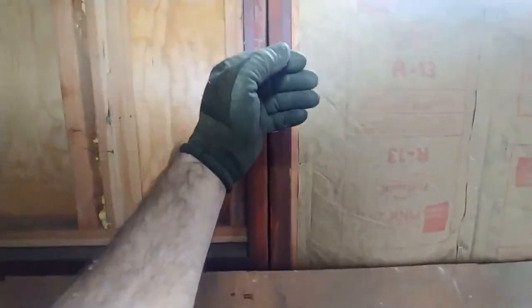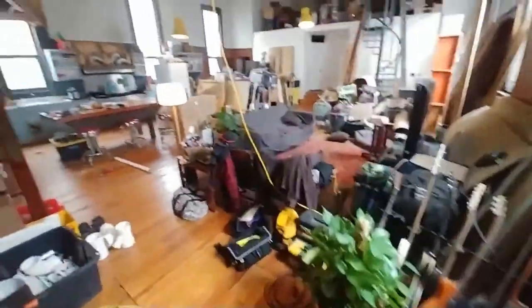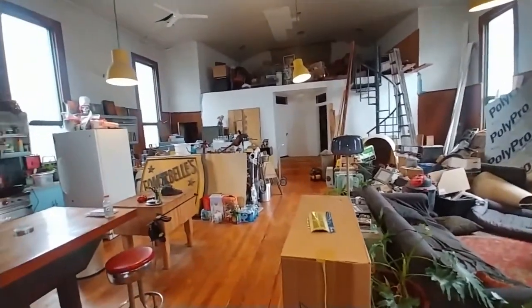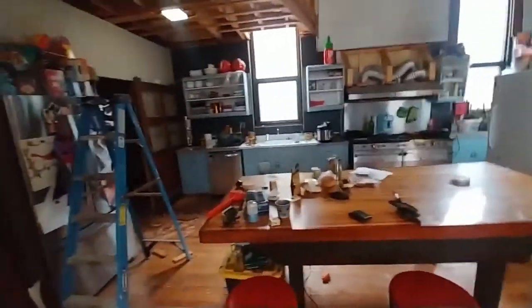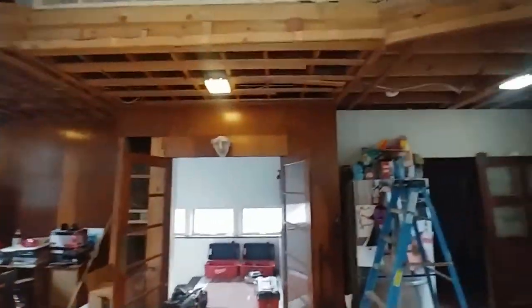And if it was me, I would have had the fully 2x6 wall, the maximum amount of R value in this entire end, considering the fact that the sidewalls of this building essentially have zero for insulation. And these are the things that increase your property value for time and effort spent and a little bit more material cost. Increase the property value, and obviously make it up over time. The heating bill goes down. But they're doing what they can in here, and we're getting it right while we're here. So come on back and see us when we get that major line all in downstairs, and we're working upstairs.